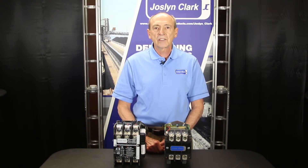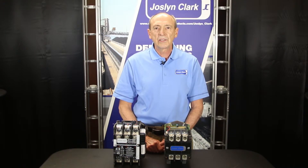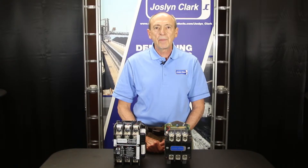In addition, the product's smaller size and higher voltage makes vacuum an effective alternative to air break devices in these and other industrial processes. However, the choice is not nearly as clear on applications involving voltage levels of 600 volts and less. Air break and vacuum devices have their own place at these voltage levels, and the optimum choice in given situations is dependent on several factors such as arcing time, temperature, contact welding risk, oxidation, electrical and mechanical life, and maintenance.